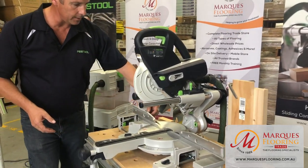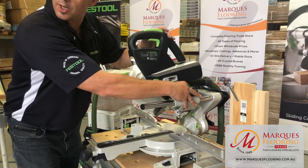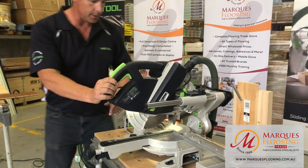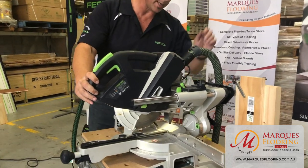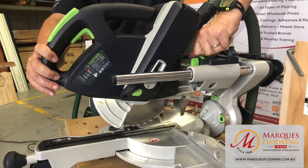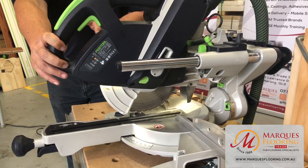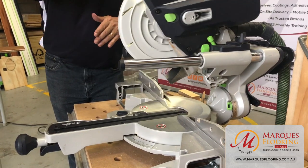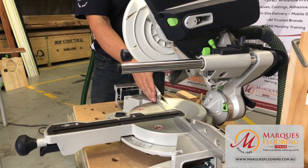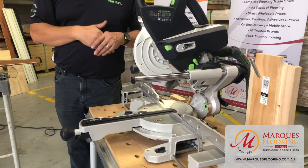The machine also has a trenching feature. Slide the lever down to adjust — you'll see the blade hasn't travelled all the way down. Adjust clockwise or anti-clockwise for up or down. For trenching, just remember you need a little 10mm packer at the back to eliminate the ski jump effect from the curve of the blade, and then you can travel all the way through your work surface.